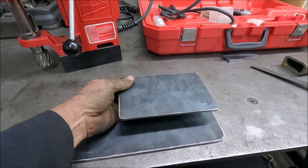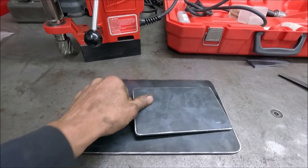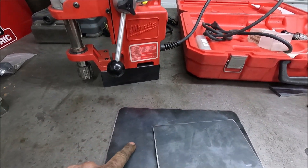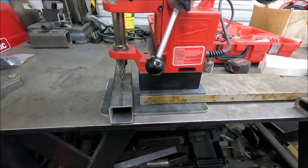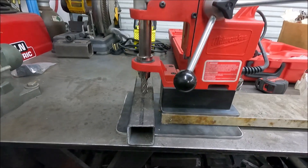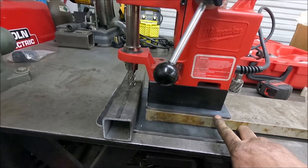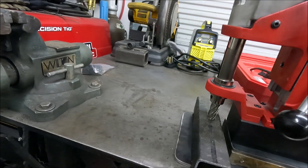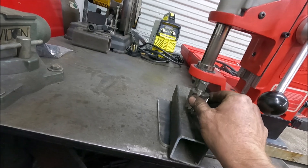This piece is going to be mounted something like that. I'll have to make some pieces to go in there to weld on. The largest annular cutter I have is an inch and a half, so I'm going to make the hole in this piece a little bit bigger than that. To be able to drill a two inch square tube, this needs to be spaced up one inch, which with a quarter inch plate on top makes one and a quarter inches. The other annular cutter that's an inch and a half is a little bit shorter but will still make it all the way through.